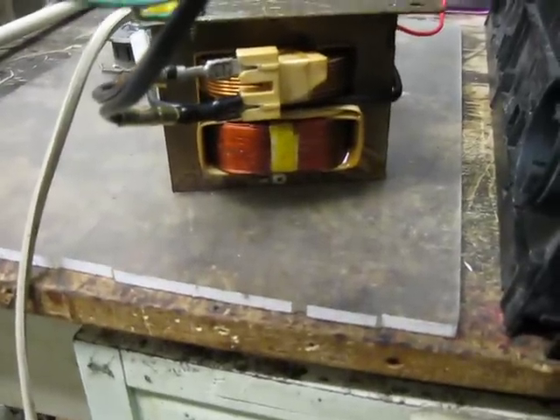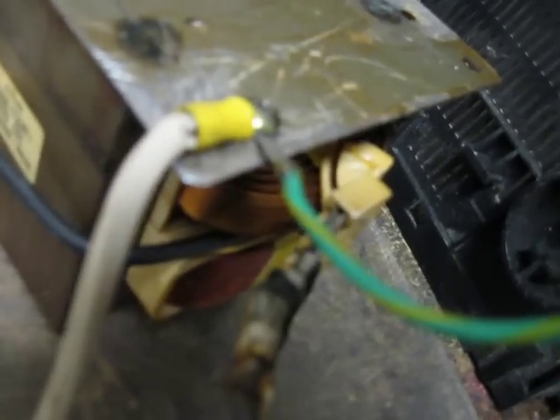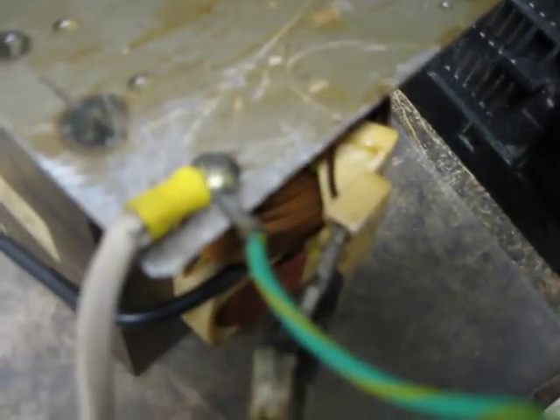To begin with, you've got your microwave oven transformer - mine's currently upside down, so that's how I have my ground bolted down to the plate, it's just easier that way for the video. You have your AC line - that's two AC connected right there. Green here is the ground, got that bolted down to the plate which is connected to the core. Whenever you're bolting your ground to the core, they dip these whole things in enamel, so wherever you bolt to the core as a ground, make sure you grind off that enamel so you get good contact.